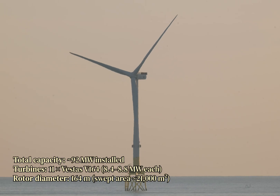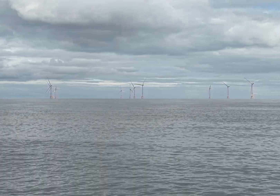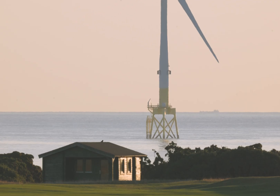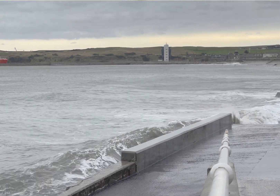These are part of the European Offshore Wind Deployment Center. There are 11 Vestas V164 turbines rated at either 8.4 or 8.8 megawatts. The rotors are 164 meters in diameter with hub heights of about 120 meters. From a distance they look pretty simple, but beneath the relatively simple facade lies a really complicated composite structure engineered to withstand decades offshore under fatigue, ocean spray, and turbulent wind conditions.